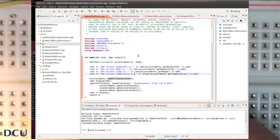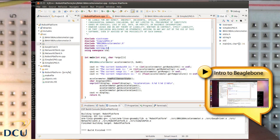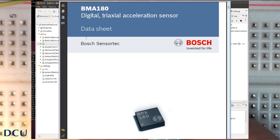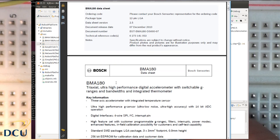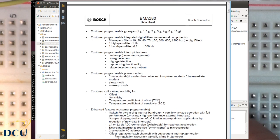Next I'm going to show how to build a C++ application that interacts with the sensor registers. I have my development environment in a virtual host on my PC, cross-compiling directly to the BeagleBone using CDT on Eclipse — covered in the previous video. To build this interaction I need my development environment and the BMA180 datasheet. The datasheet is fairly complete though some things like temperature values have quirks.